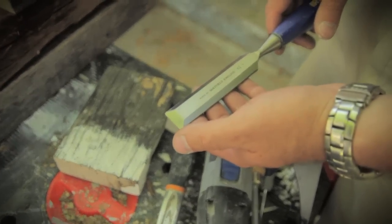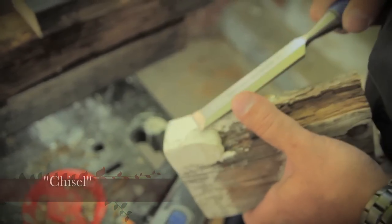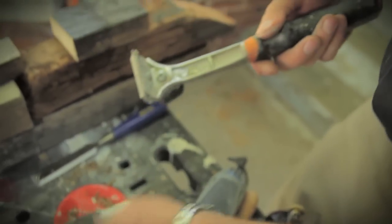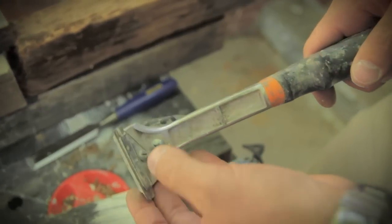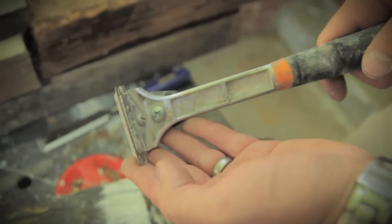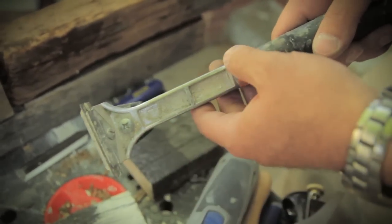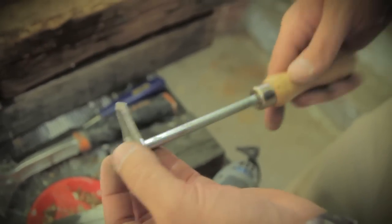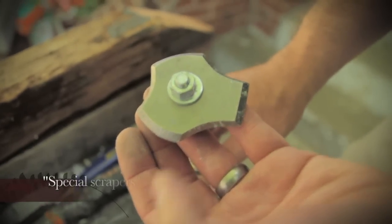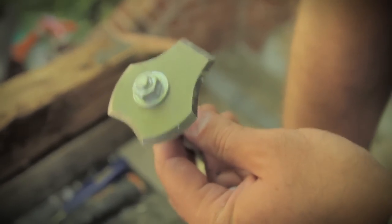Here's an introduction to some of the tools that are useful during any kind of woodworking project. First up is a good old-fashioned chisel — very handy for when you just need to smooth a few pieces or cut out a nice notch. Next is a carbide scraper, a great way to get paint off of an old home. With any home built prior to 1978, you want to be aware of the lead hazard — wear a lead-approved respirator, have adequate plastic on the ground to catch lead chips, and if you're hiring someone, make sure they're EPA lead-safe certified. There are also a variety of profile scrapers that can help you get into odd OG curves or other profiles on your trim, and this one comes with a few different blade types.